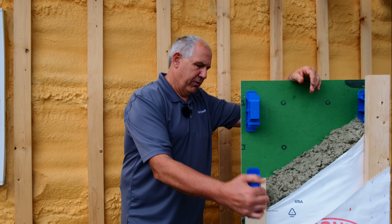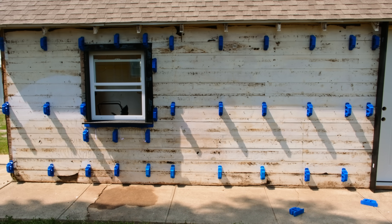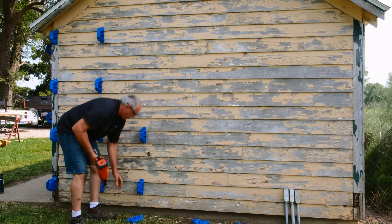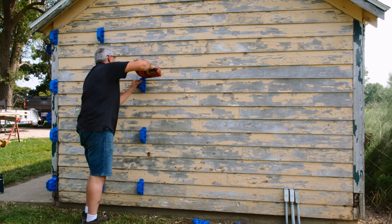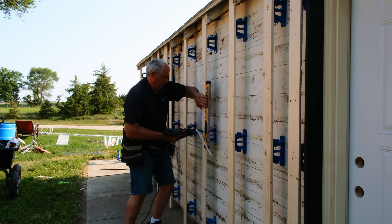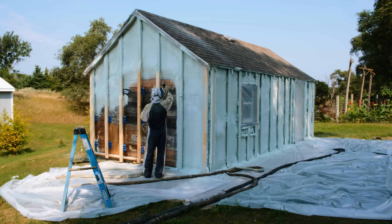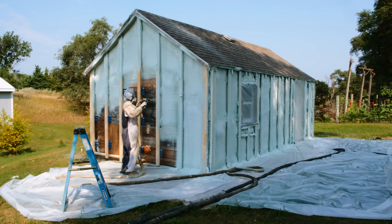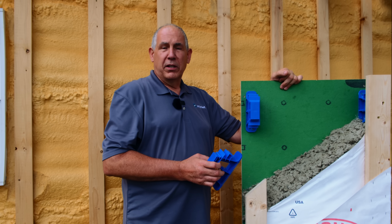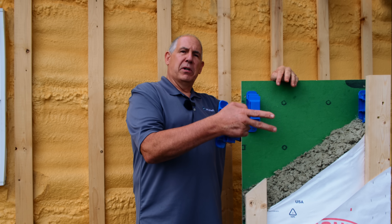You can take that 1920s home and put these brackets right over the outside of the cladding and siding — even the ones that have lead paint that you're worried about pulling off. You can go right over that siding. If you go over the siding versus tearing it off, you're going to leave 10% more of the value of the wall in place, plus you don't have the dumpster. The brackets go over, spray foam goes in, and you're going to get that same passive house standard for your air if you go all the way up the wall and over the roof. Especially that story-and-a-half is a tremendous fit for this, where you can get the insulation continuous all the way up.